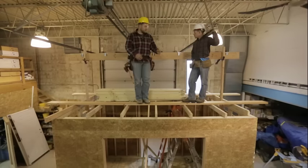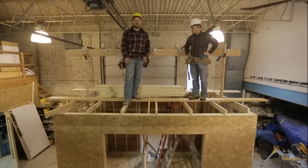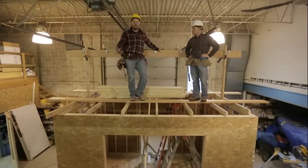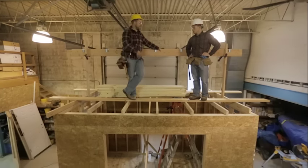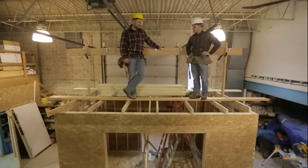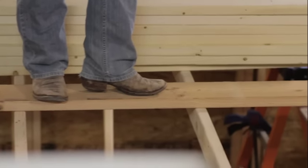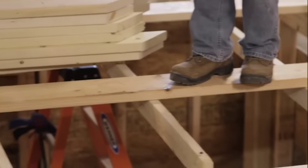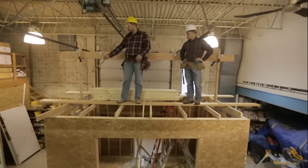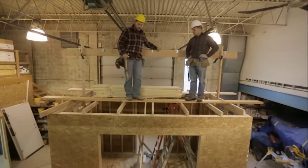We've also installed our ceiling joists for the interior. This serves two purposes. One, we've installed scaffolding — it's basically a good platform to walk on. If you have a larger home and can't span your ceiling joists yet, you can set up scaffolding along the ridge, or if your peak is too high you may need scaffolding. A quick safety note: we have a two-by-eight to walk on, screwed down so it doesn't shift — really important when working with volunteers. We've also installed two two-by-fours on the ends temporarily until we get the roof framed.